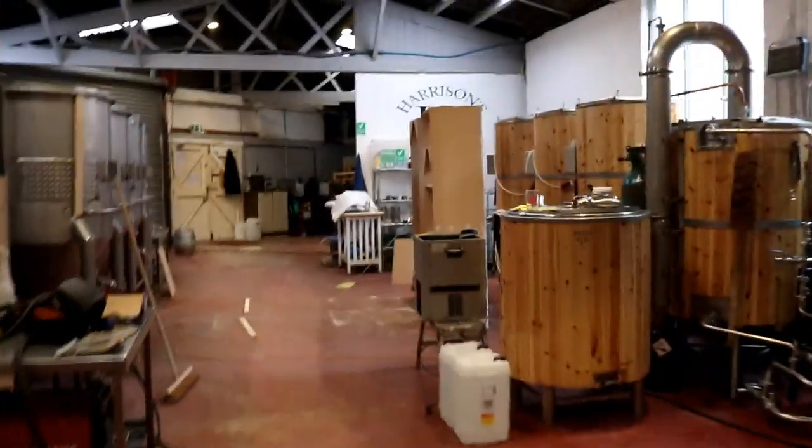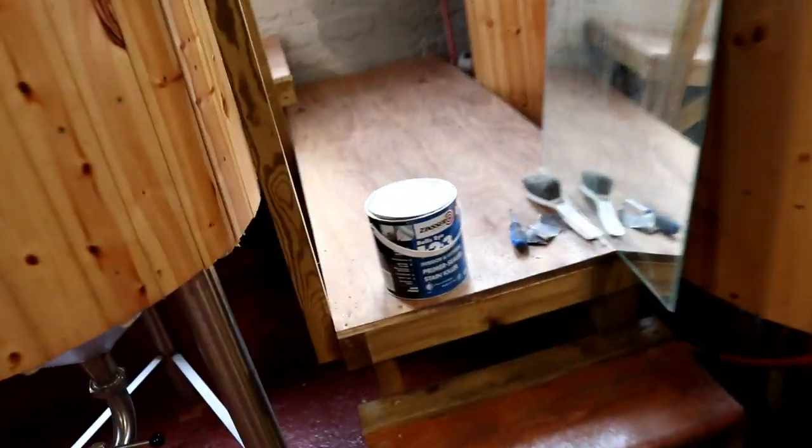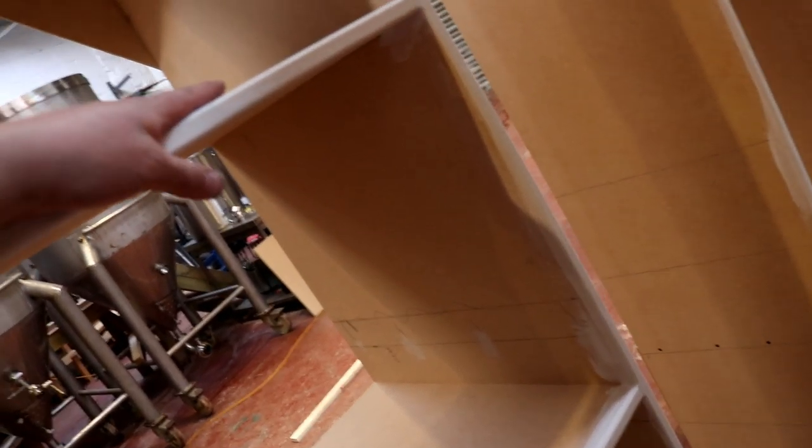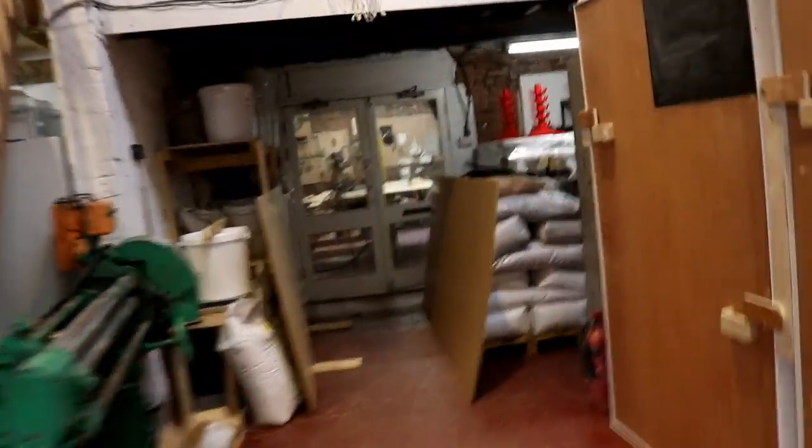If I take you outside into the brewery where we don't have half as much dust, I'll show you exactly what I mean about sealing up the ends. This is the stuff again — recommended by the same guy on YouTube. I'm going to have to leave a link in the description for him because he's helped me out no end. This is basically what you do: you just paint the end grain with this stuff, knock it back with a bit of 160-240 grit, and then that is ready for an undercoat. I'll be digging the sprayer out for the undercoat and we'll be doing it with the spray gun and the compressor.